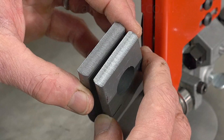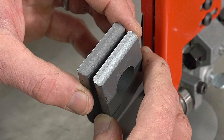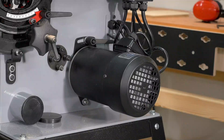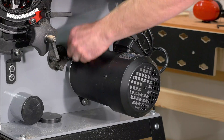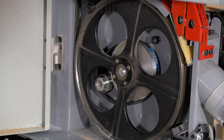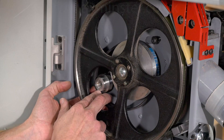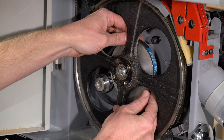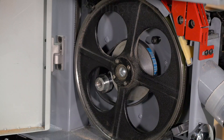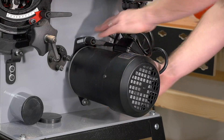Now with a suitable blade — a quarter inch, 14 TPI — you can even do tight curves in metal. To change the speed to the slower speed setting, simply release this lever, move the motor across, change the belt to the other pulley settings, and re-tighten the motor. Not only does it slow it down, it also gives it a lot more torque.